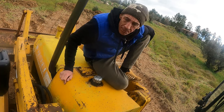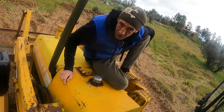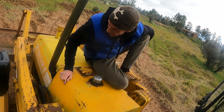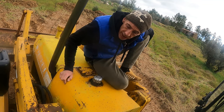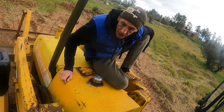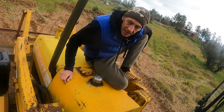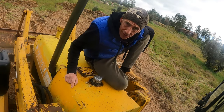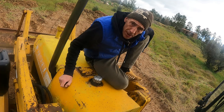Well, Alex has an assumption. As soon as we turn the machine off, you hear a hissing sound, and apparently we traced it back to the release valve of the gearbox. Alex says it's rushing oil back into the gearbox after it turns off, and it's releasing air that is in there. But Alex says it shouldn't be so much air coming out. The transmission is automatic, and it's a very ingenious system with sort of canals where oil travels through and then activates the right gear. So Alex is suspecting that maybe that is jammed up somewhere.